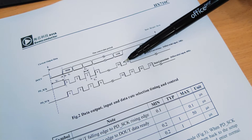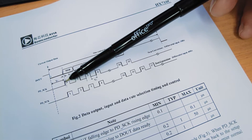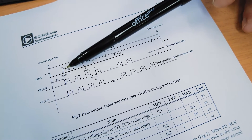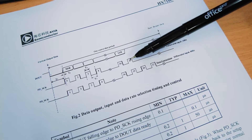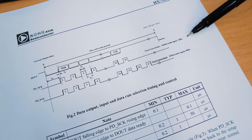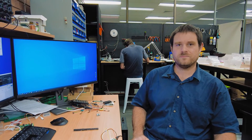We need to produce 24 clock ticks to read in our 24 bits of data. The clock ticks have a rising edge at which point the data line can change value, and on the falling edge we can assume the data value is stable and read it in. At the end, we have either a single pulse or three pulses that tell the ADC whether we want to be sampling at 10 hertz or 40 hertz. If we were doing this in C or C++ on Arduino, we would bit-bang that out.